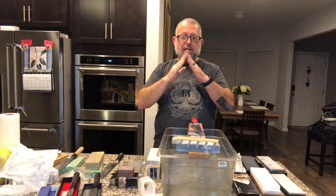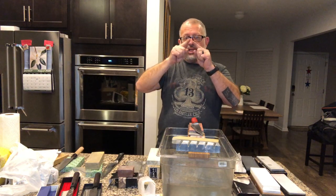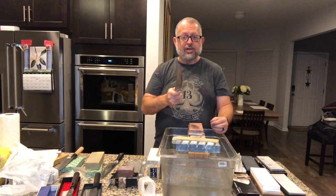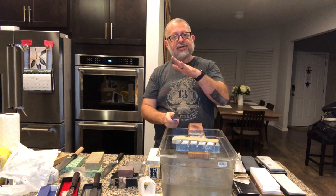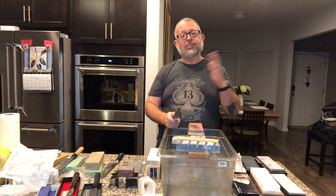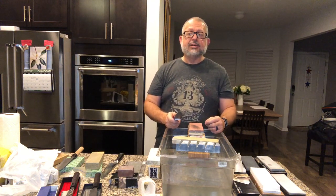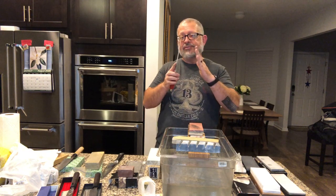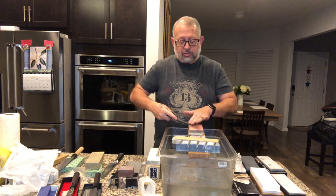Would we have a perfect triangle? And you know that we would not, because when the cheese broke off, there would be jagged edges where the cheese broke. So when you go to take the burr off, where the burr came off you still have toothy edges. And so you actually have to get the burr off, and then you need to go back on an 8,000 or something, even a 3 or 6, and now work on reforming the triangle. And that would be a good time to do your edge leading strokes.